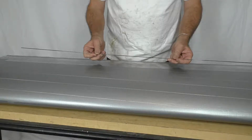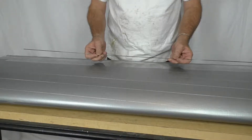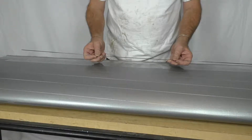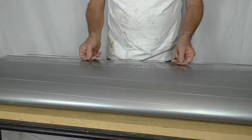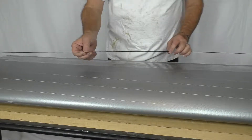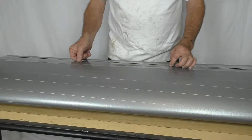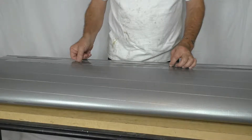meaning an individual rod can carry thousands of pounds of load, which is essential for my wing. At 6 G's loading, this wing has approximately 30,000 pounds of load in the spar caps. So with about 30 of these — they are a sixteenth of an inch in diameter — with about 30 across the top and bottom of the wing, I can carry 6 G's of load.